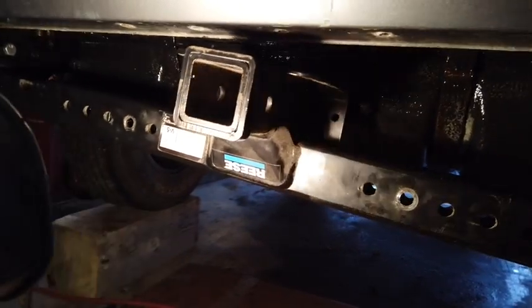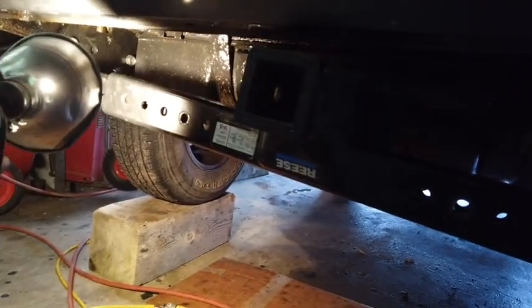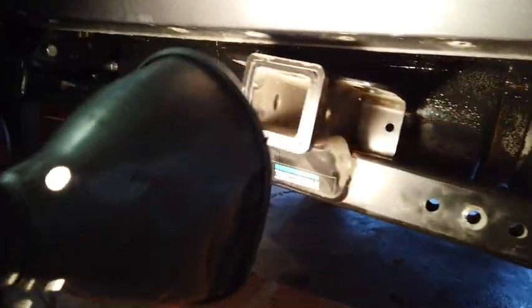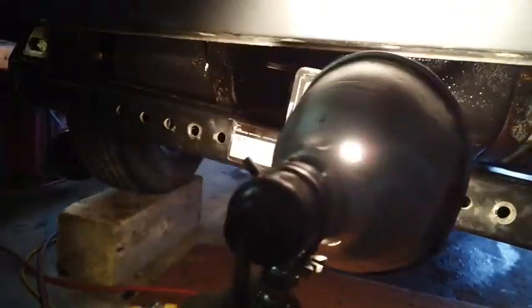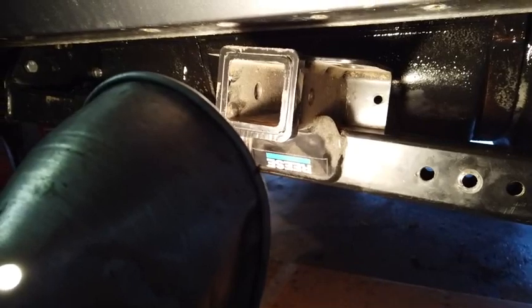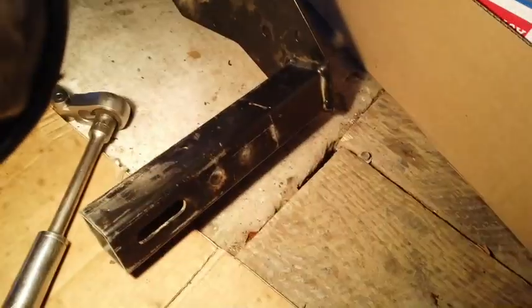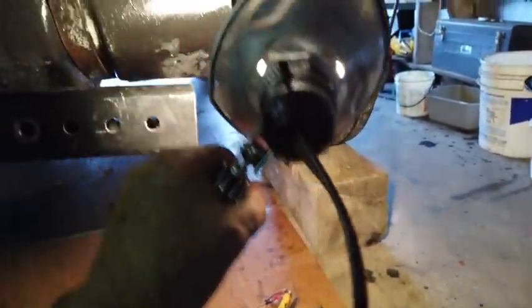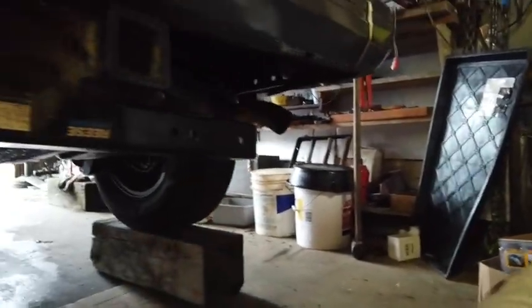So what I may do is, right now the side mounts are bolted up solid to the frame, but the little bolts on the side there are still loose. So I may grab my little grinder, mark a line in the center, measure out on both sides, and then cut about 1 inch out of that bumper, and then ease that up into place and see if that'll give me about the right amount so that I can slide this other piece over in here and then attach it up in here. Okay, so I'll get my grinder and we'll do that. Oh, the joy.